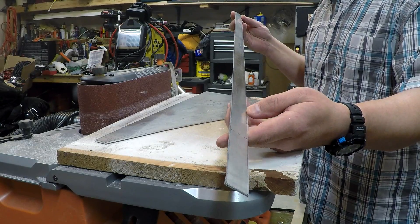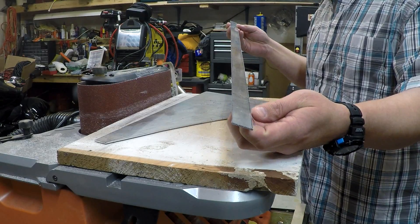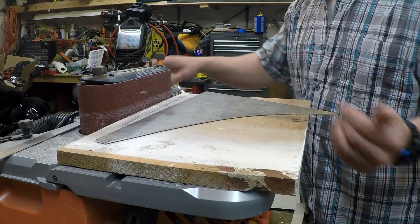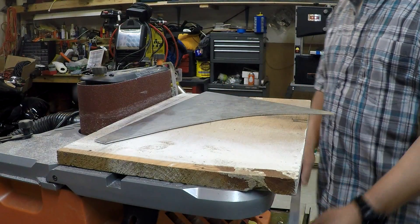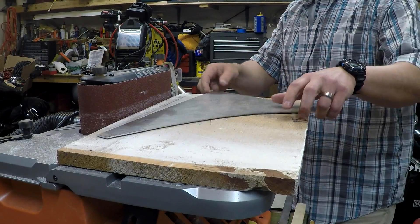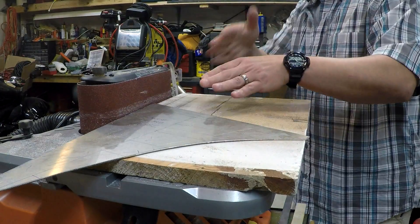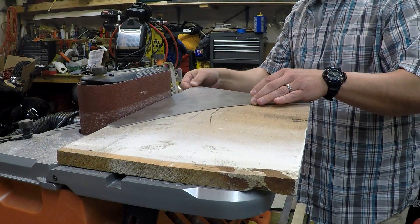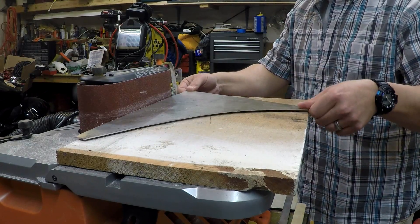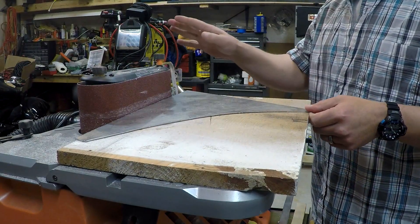The edge that the saw leaves definitely needs to be sanded down, and if you can't get very close to the line you've got quite a bit to sand down. The method that works for me on these larger pieces is to take the horizontal belt sander and move the piece across against the traction of the belt in a continual motion, sliding it across the sander so that I don't stop in one place for too long, because I can cut a channel into it if I do that.